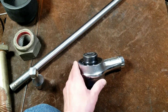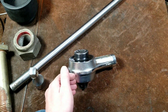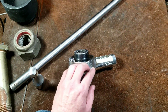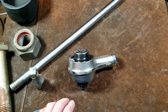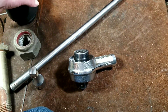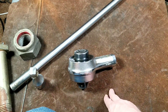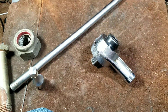Another thing to mention about the 15% losses and the 3.4 ratio: it's easy to calculate — if you want 340 foot-pounds out, you need 100 foot-pounds in. To achieve the 2,000 foot-pounds output torque you would need 600 on the input, which is once again just crazy. So even though you have a multiplier, you may still be putting a whole lot of force into it. With large fasteners and inch-drive sockets, breaker bars often just aren't enough — you really need one of these to effectively use large sockets.